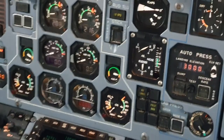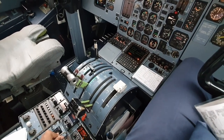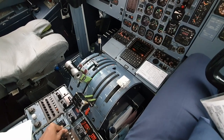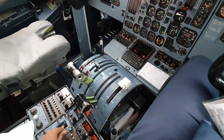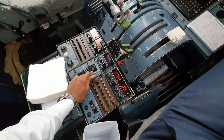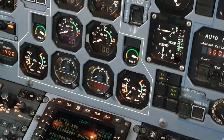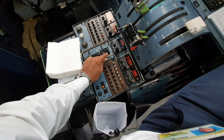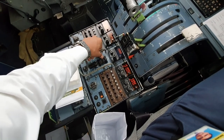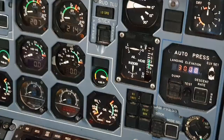See that. And now let's go back to neutral. And now there's a further test that when you press them individually, there should be no movement of the trim when you're using just one of the rockers. So you need to test both sides, that if we press either of the rockers, the trim does not indeed move.